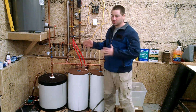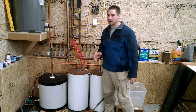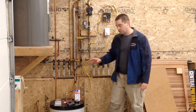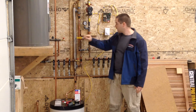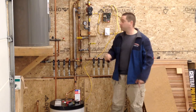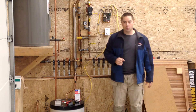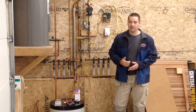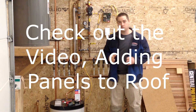Further update to the solar system for trying to heat the garage. I've had a lot of hiccups along the way. Now we've got the drain back tank, the pump moving the fluid through the panels, coming back through this stainless steel heat exchanger. The water that's in the radiant floor is being circulated with this pump. This system is working, but I know it's not quite enough. When we hit the middle of winter with some of those negative 10 degree Fahrenheit nights, this is not going to be enough. So we need to heat it more.